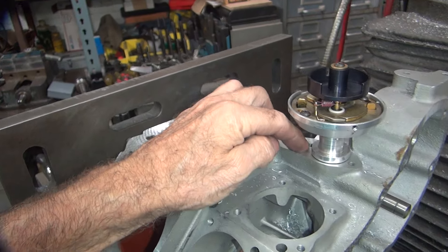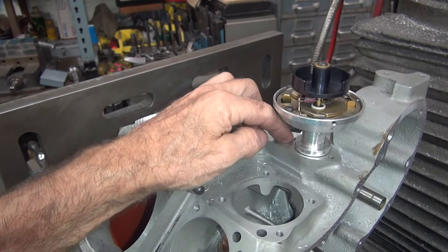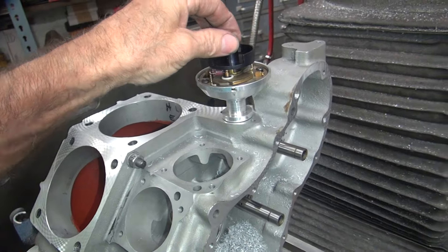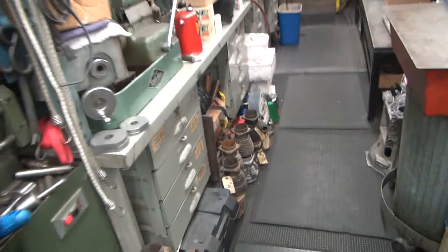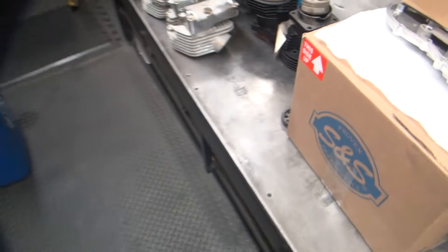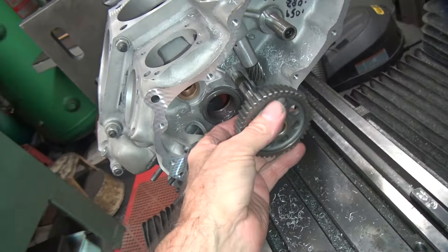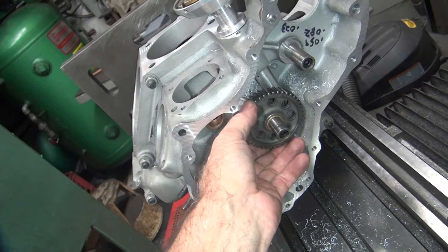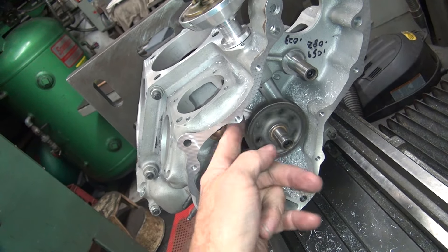You can plug the hole and re-drill it to have it slip over center, or you can slot just the one hole — though it's better to slot both holes. The least amount of damage is a modified distributor. But if you have any late style distributor with the common clamp, then it's easy. We need a circuit breaker drive here — kind of resembles this piece right here. I think this is the one out of his motor. Look at that — nice, no drag. Slips in there like it's supposed to.